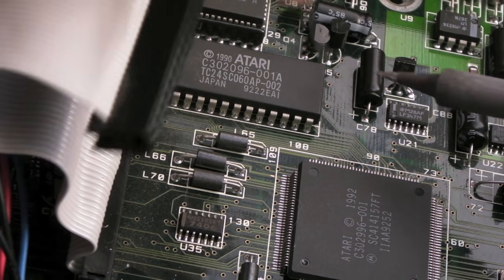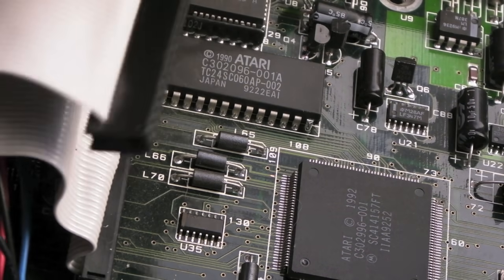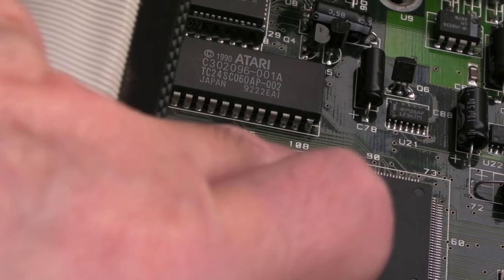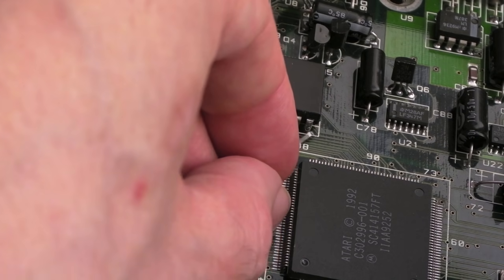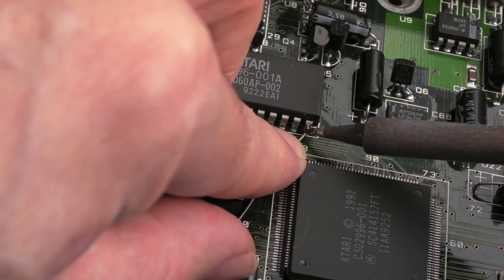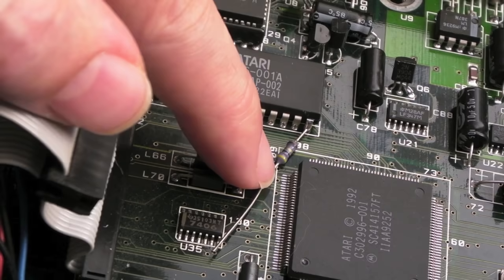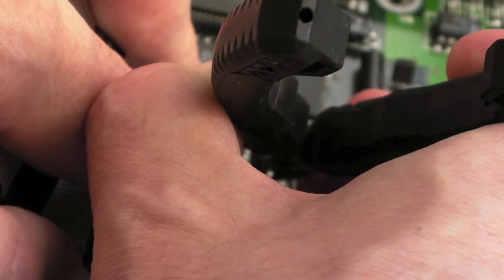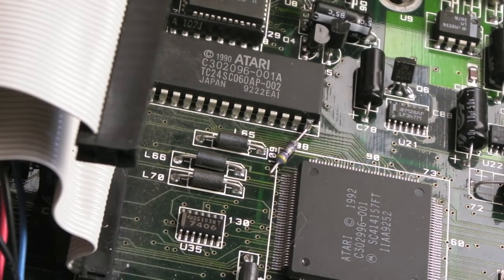What we need to do is take a resistor cut to size, get a little bit of solder onto this leg — this is ground, I've just tested that. I've scratched the second trace going to this chip from the top side, second one down. This is all on the CT60 website. We need to join a ground here — heat that, there we go, that side's joined. I need to trim this off so it's just the right length to overlap, then remove that leg and bend it down a little towards the trace.